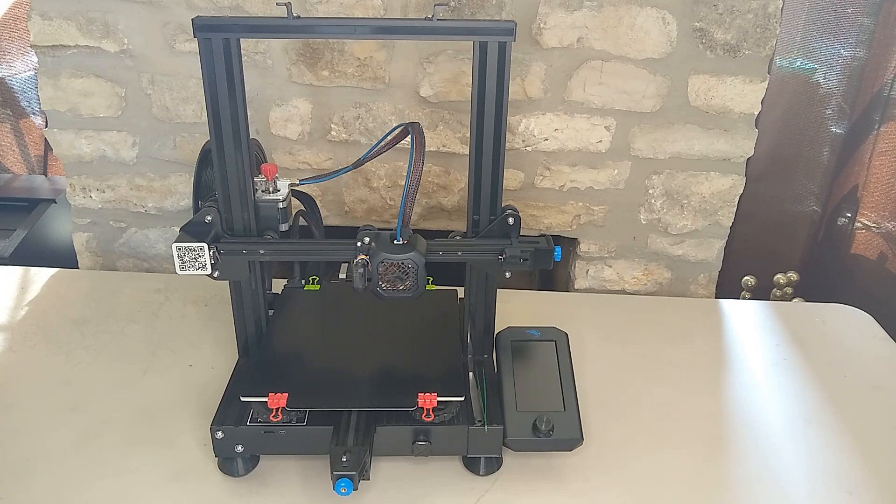Hey guys, so in this video I'm going to go over a few questions I've been getting repeatedly regarding printing with PETG. PETG is a fantastic material — it's more heat resistant than PLA by a long shot and almost on par with ABS. The beauty of PETG is that it is easy to print with. It doesn't warp like ABS and nylons, but is more robust to temperature than PLA. The problem with PLA is it has very little heat resistance — you take a PLA part out in the sun or in your car and it will just start to deform right away. You can't leave it near an open window.